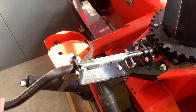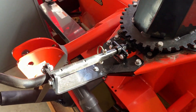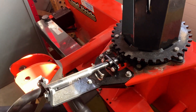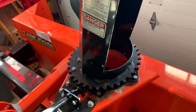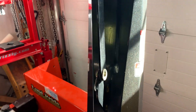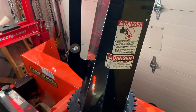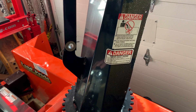This is the method of cranking the chute now, and it's not so much that I mind reaching back and cranking it — it's actually not that bad. There are two problems. The biggest problem is that this moves really smoothly, which is great, it doesn't hang up anywhere and it's not floppy. But it moves very freely, so when you're blowing snow you might have it set to a specific angle, but the actual force of the snow pushing against it will sometimes kick it around and cause it to rotate a bit. That's a problem when you're trying to keep the snow off the driveway.